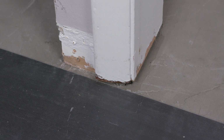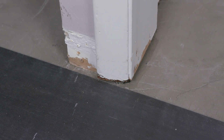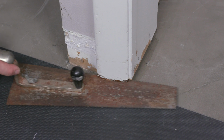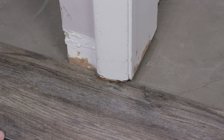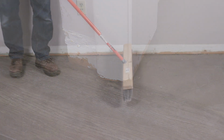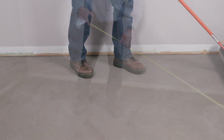Begin by undercutting all door jambs by using the back of the product or a scrap piece of flooring to determine appropriate height, and cut using a power tool or a basic undercut hand tool as shown in this video. Undercutting the doorway moldings the thickness of the flooring will ease the process of measuring and cutting the material during installation. Sweep and vacuum or damp mop substrate to remove all dust and debris.